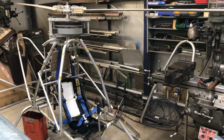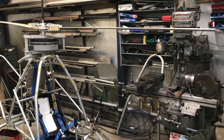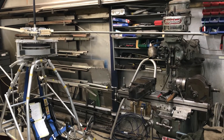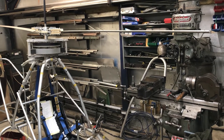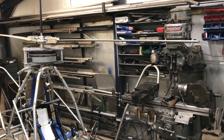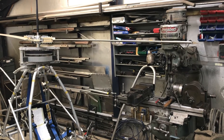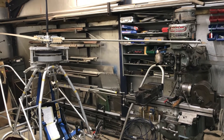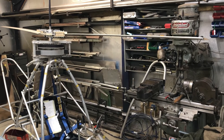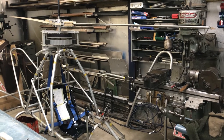I worked out the strength using SolidWorks — I calculated the cross-sectional area of the blade and worked out from the pounds per square inch rating of the material what the load-carrying capability of that section is. They were built to fatigue strength, so in theory no matter how many cycles they're put under, they shouldn't fatigue. That's the theory anyway — that's about it, cheerio.